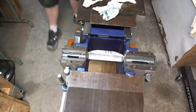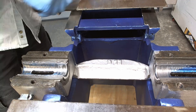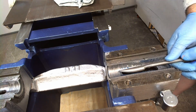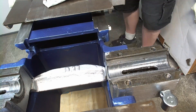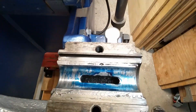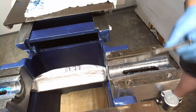Repeat and do it again — you can see just repeating the scraping. The cool thing is it depends on where you're pushing as to where it scrapes, so it just takes a little bit of practice to get the scraping where you're trying to clear out the blue. You only want to scrape the blue to lower it. There's round three — more coverage. Initially that side didn't have anything towards the center, and now it's a lot better. Each time it's getting better, so that's good.